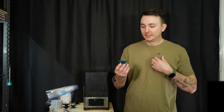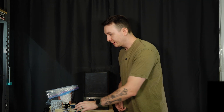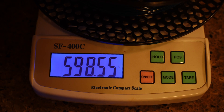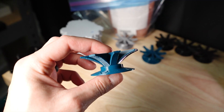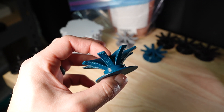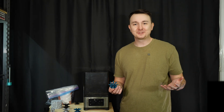There's so much stringing on this print and it just looks awful. So what do you do about it? You dry it. I took the roll after it had already printed and I weighed the filament. Then I dried it for six hours and weighed it again. You can see there was about a one gram difference between the weight before and after it was dried — roughly 0.15% of the filament's weight minus the spool was removed after drying. Some water did come out of the filament, which is also in line with other videos I've seen on this topic. So I ran another print after drying it, and the stringing is gone. This print isn't perfect, but some of the symptoms of wet filament did go away. I'm sure the rest is tuning-related, because I ran the stock profile and the same G-code on both prints. Filament dryers actually do something, and I'm not out of my mind.